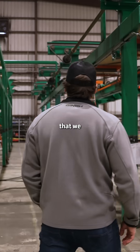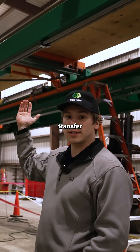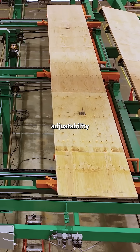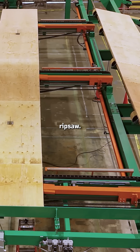If you walk with me, you can see that we actually provide a lug system. This system will actually lift the billets and transfer through end trim saws. We have saws on both sides with adjustability on the far end. Once it's through the saws, we actually receive it on jump skids that lower and feed the rip saw.